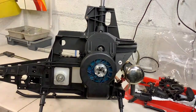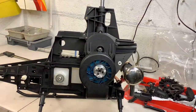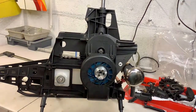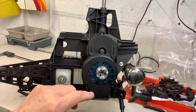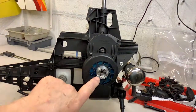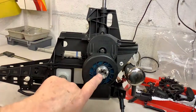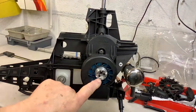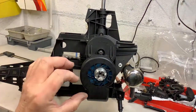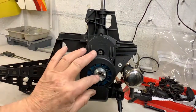It took me hours and hours to get it undone, and a lot of heat, and it was an absolute nightmare. So I didn't want to go back to that routine. So I've modified the way the shaft goes onto the engine. It had a very thin sleeve that went into it, and that was actually locking up against the bearing face of the engine.